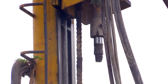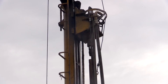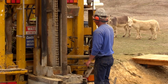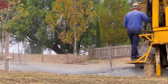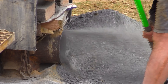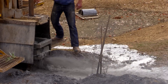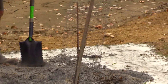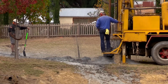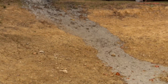But if we've got to go deeper it can obviously take longer — we'll give you an estimate of the time when we come to give you a quote. At 18 metres, that blue mudstone turned to blue sandstone, which is a harder rock and where we get our water. Back in time when the earth here was pushed up by volcanic forces, the harder rock was the one that fractured, and it's these fractures that allow the underground water to actually flow through. So getting to that blue sandstone is the key to getting to your water.